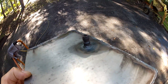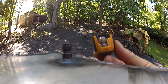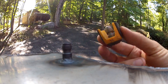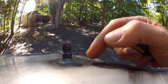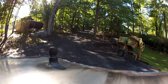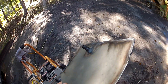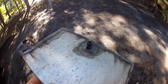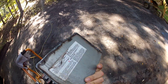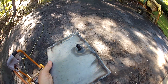It's basically a copy of the actual pressure nozzle outlet — I just took the dimensions and made a steel one that I could weld into this piece of plate. You can make up an infinite number of those without pipe fittings, or you could buy one with a threaded end and thread it into a pipe fitting and weld the pipe fitting into your work. This is a folded-over piece of sheet metal.